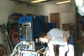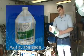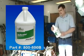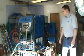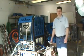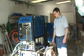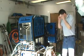The descaler that Hydromaster sells is called Safety Scale, and its part number is 800-800B. This is a good scaler for use in maintenance descaling and is not hard on the chemical system or the solution system inside the machine. So to begin, we'll put on our safety equipment.